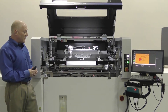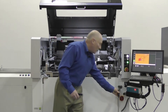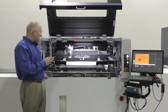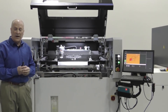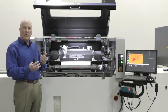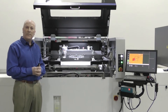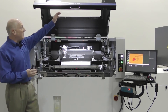We have local verification available, as you can see from the scanner system attached to the machine. We can do verification of the stencil, the solder paste materials, your squeegee blades, and backup support systems if you have such. The backup support mechanisms on this range from magnetic blocks to selective pins for eccentric or column pin type supports. We also offer vacuum backup and gridlock type systems — very flexible for any range of manufacturing needs. Very high speed.